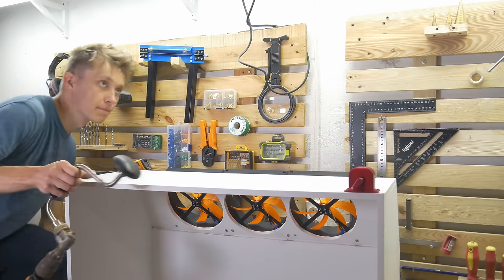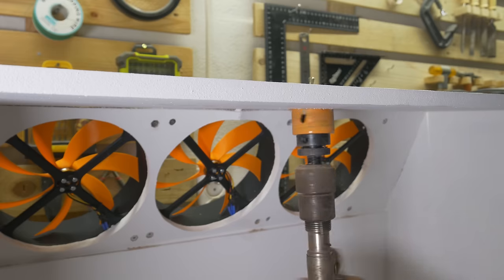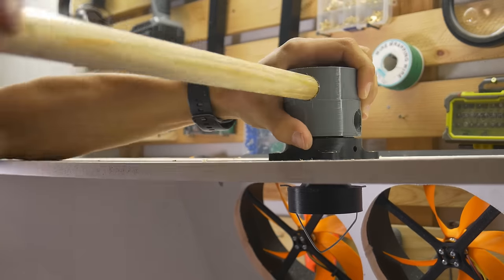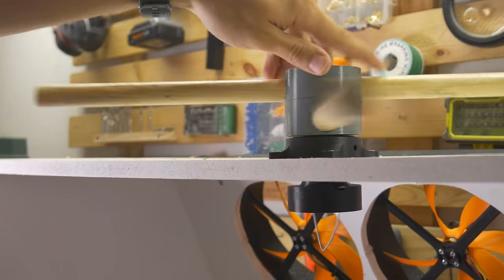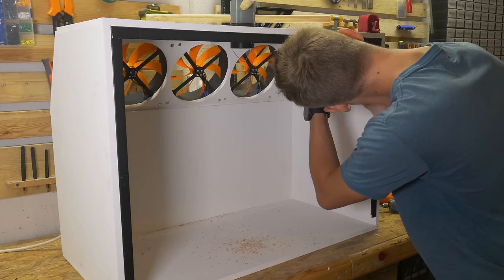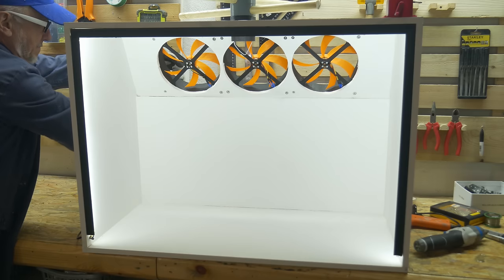I'm drilling a small hole where I will attach my 3D-printed carousel. There were also 3D-printed parts involved in building the carousel, which rotates the parts while I'm painting them. I used a bearing ring to both rotate the parts and make the electrical connection between the part and the alligator clip from the powder coating gun. Some additional wooden sticks made a perfect handle to easily paint the part all around. For nice results, lighting is very crucial — you need to see what you are actually painting. A simple LED strip will do; I used one that is water-resistant and covered in silicone so it's easier to clean and the paint won't mess up the LEDs.